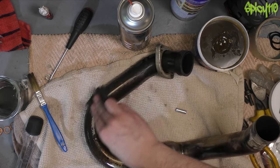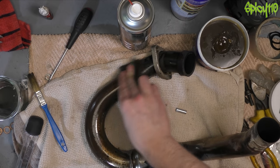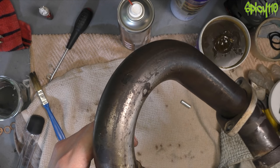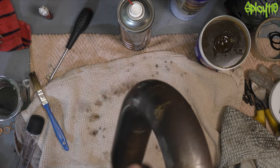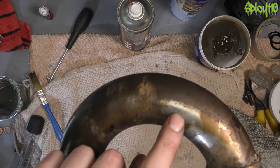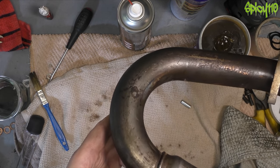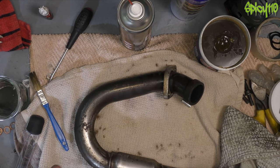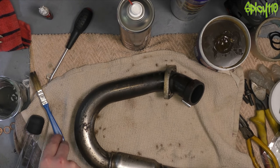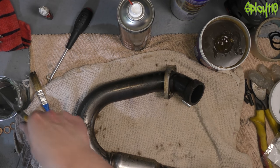Let's have a quick look — I'm going to use a scouring pad and see what the phosphoric acid has done so far. Well, as you can see, that's starting to work its magic. To give you a good contrast, you can see the other side here — that's like silver stainless. It's just taking all of this off. So that looks like it's going to work — it's a good solution because you get the chemical cleaning with the phosphoric acid, and then just do the normal sanding and polishing for a decent result.